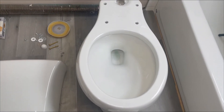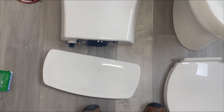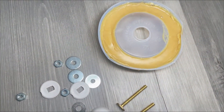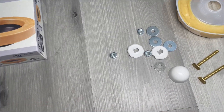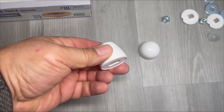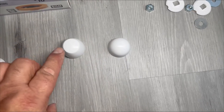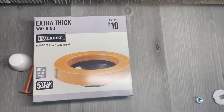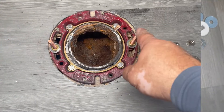In the box you're going to find the bowl, the toilet seat, the tank, and the tank lid. It also comes with the wax ring and the bolts for the flange, but it does not come with a water supply line, so don't forget to buy that separately. I'm also using a Fluidmaster fill valve I bought separately — if you use Fluidmaster you don't have to cut the bolts because the plastic is longer, and I'm going to use stronger, thicker screws.